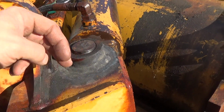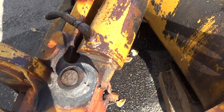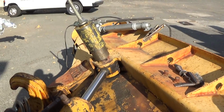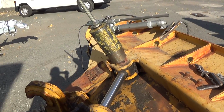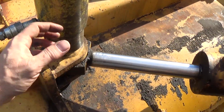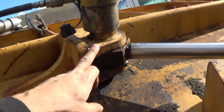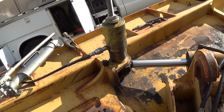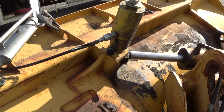I may have to just exothermically pierce through the entire thing. I don't know. We'll have to see. Maybe a little bit of trying, and we'll take it from there. But let's go one step at a time. Let's try to get this one out. I'd like to set this up so you could watch a little bit of this. It's no big deal. Assuming nothing lets go, with the hollow cylinder and the threaded rod welded to the pin, it will draw this out. I've had moderate success with that, so that's what I'm doing. Let me get on with that, and we'll see what happens.